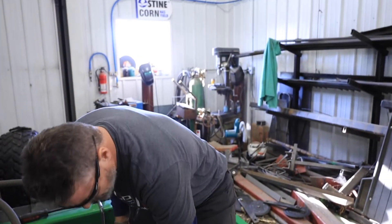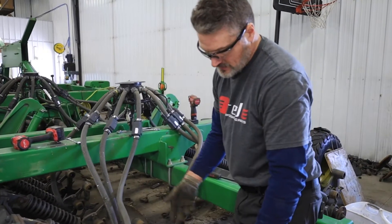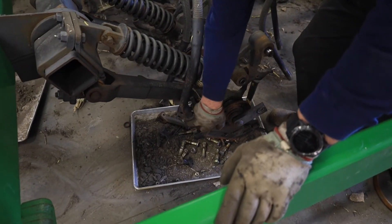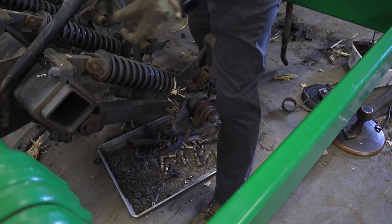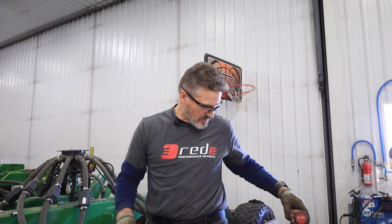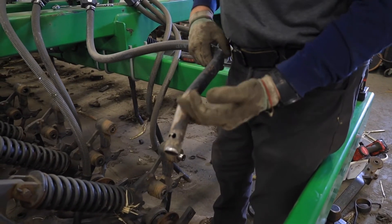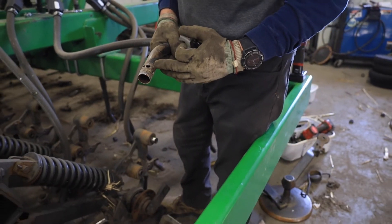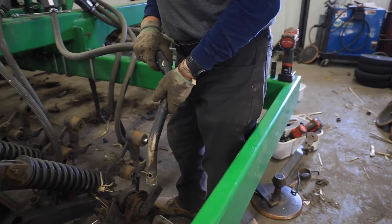As you can see, this depth shaft is really stuck in there. The fastest way to deal with that is just to cut off the shaft, and then we can get to the spindle nut and run that nut off. But before I do that, I'm going to take this seed boot off — take out the bolt for the tube, then take the seed boot bolt out. Now in cases where these are stuck, particularly on this drill, what we've been doing is cutting the end of this tube off with a bandsaw, sawzall, or whatever you have, and then reinserting it into the new boot and re-drilling a hole — and the tube is almost as good as new again.